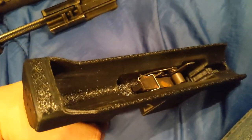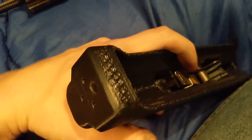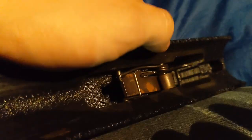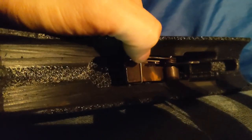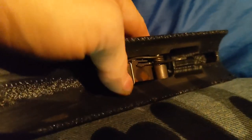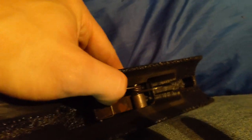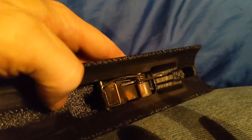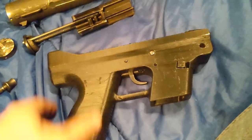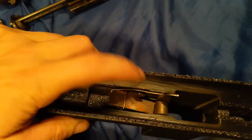You can see when the trigger is pulled, it just pulls down that sear. And then when the bolt moves, it hits this piece, which resets this piece. So when it's fired, you've got to let off the trigger before you can pull it again — that's the semi-auto. They would call that the disconnector.